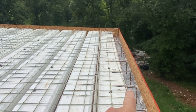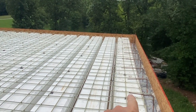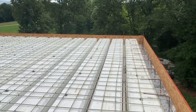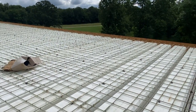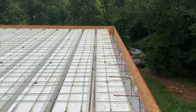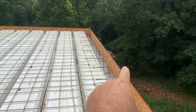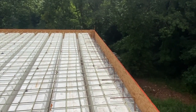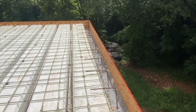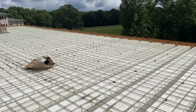But what I'm gonna do is fill up this beam here and these beams up to this height in a 25 by 25 area. That gives that stuff time to let the plasticizer start to dissipate and stiffen up. Just because I don't want to put all the pressure on the plywood right off the bat, I'm going to fill it up 12 inches thick. Then I'm going to put the 3.5 to 4 inch cap. And the only thing we're left to do here is grade pins, guys.